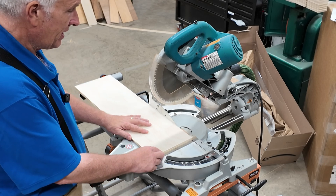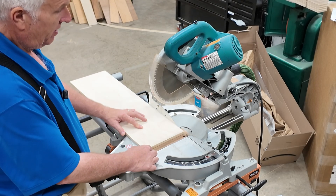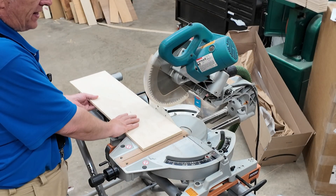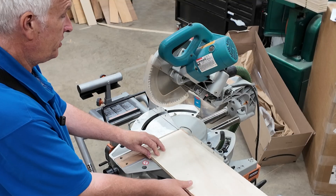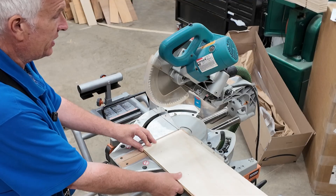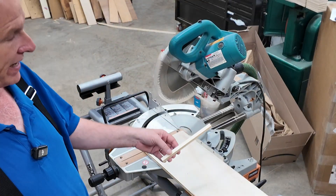What I'm going to do is make two cuts on this saw. I'm just going to establish an edge here, and then I'm going to take this board and flip it over like the page of a book, and cut the same edge — aiming for maybe half an inch — but from the other side.